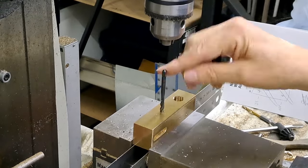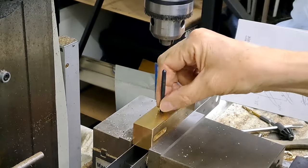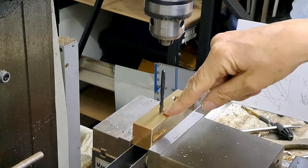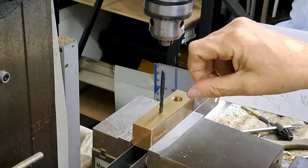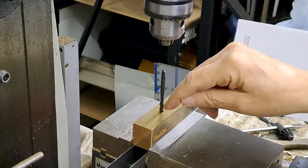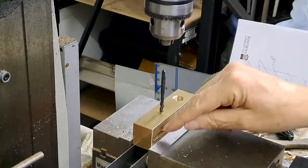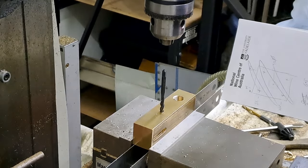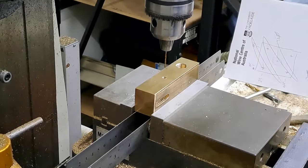There we go. We'll just get the hand wrench onto there, tap it to the full depth that it can. Then I'm going to take this out, and then I have to drill a 1.6 millimeter hole just a little bit further, so that will eventually break through into the bore that runs through the whole thing. I'll bring you back onto the bench when I've got all that done. Won't be long, guys.